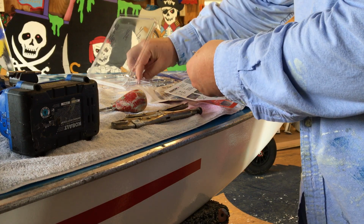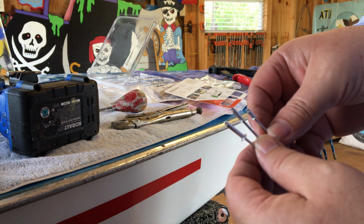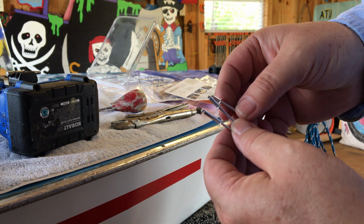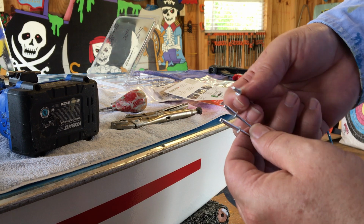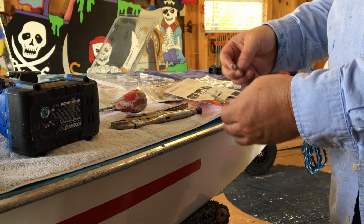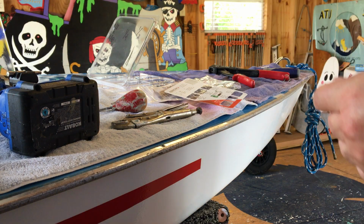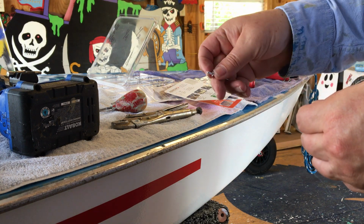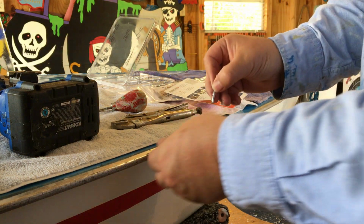We've got 3 different grips here of 1/8, 1/4, and 1/2. Sometimes it's like Goldilocks. Sometimes the 1/8 is enough. Sometimes it's too little, the half's too big, and the quarter's just right. So, you know, each boat's going to be a little different. Each piece of trim's a little different. Depending on whether a hole's been drilled all the way through or not, you can get away with this deeper one. If it hasn't and it's original, then maybe the smaller one. So the Goldilocks rivet today is this 1/4 inch.